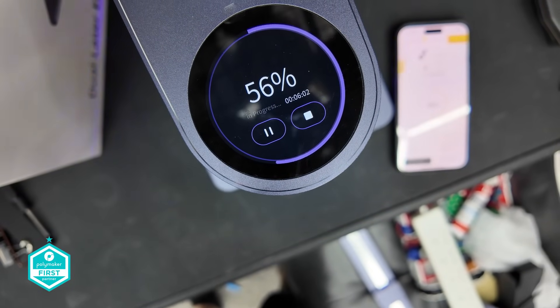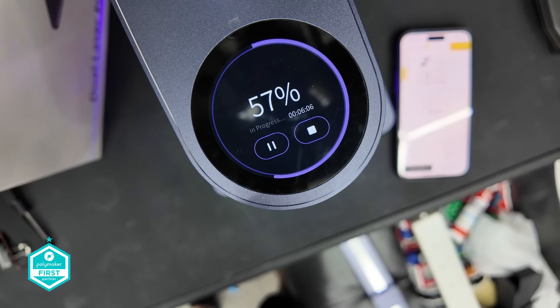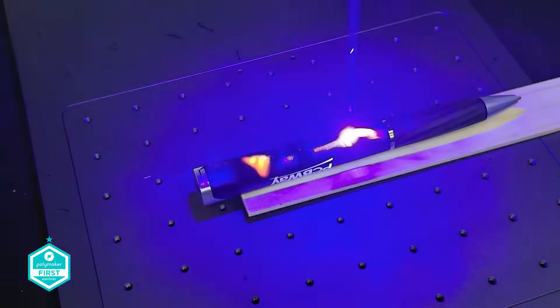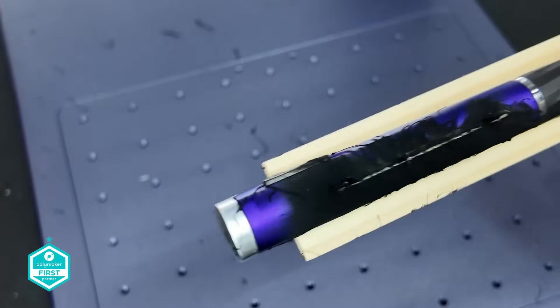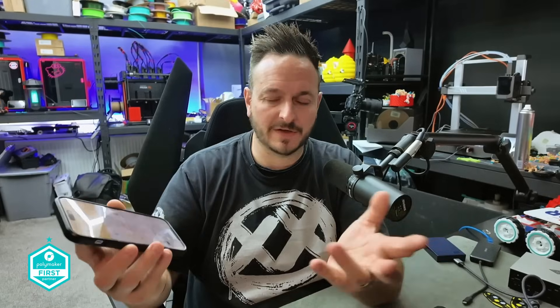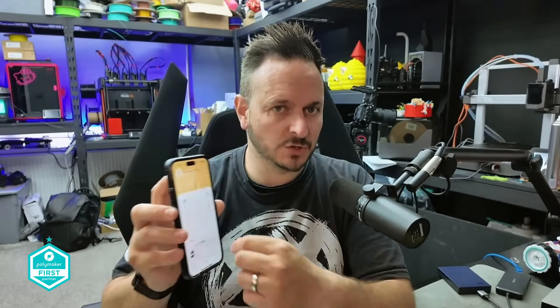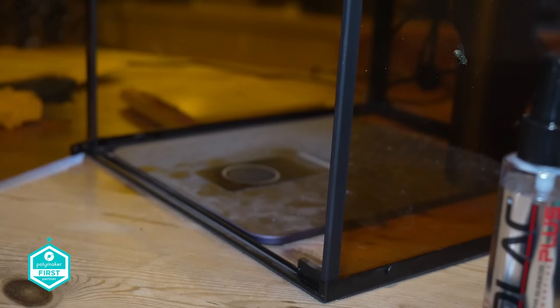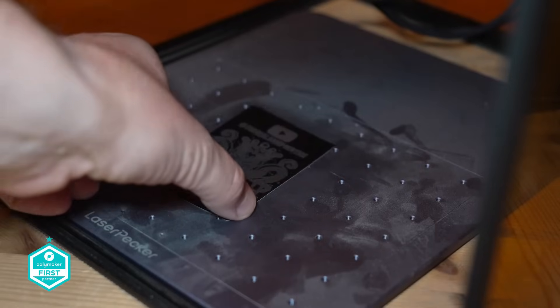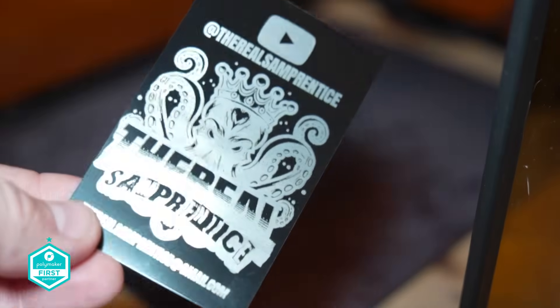On the laser, there's no camera, so you'll just be watching the percentage bar as it runs through the program. You can pause it or stop it altogether, which is exactly the same as you can do on the LCD screen on top of the laser. I personally prefer using the app, though I am a bit gung-ho — I did actually melt a pen. So reading the instructions and starting off slowly is probably a better solution for most people. The good thing about the app is that you can drop down and select the material — be it slate, metal, leather, whatever — and there are some predetermined settings that you can use, which you can also adjust to make the experience more enjoyable.